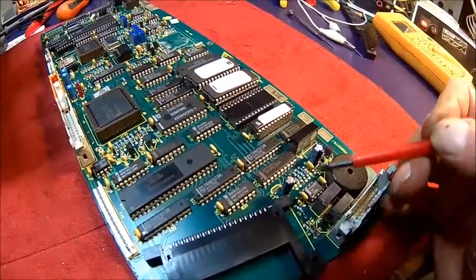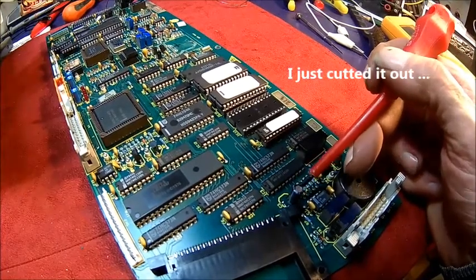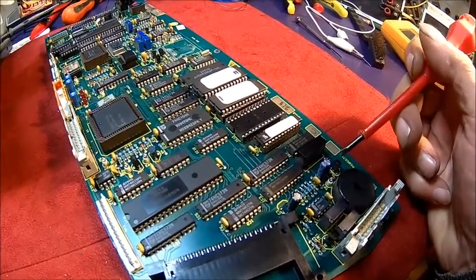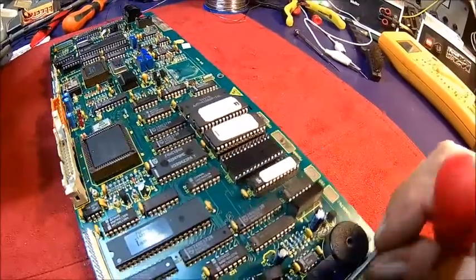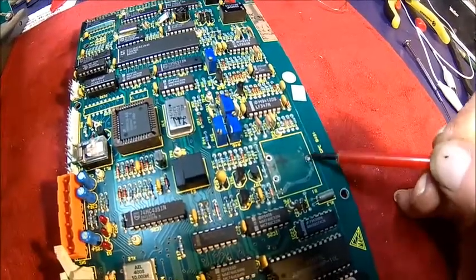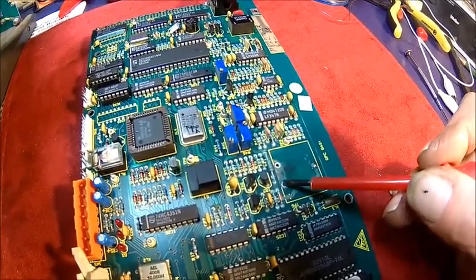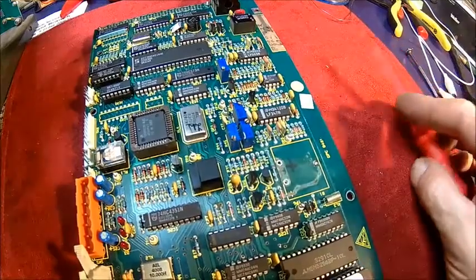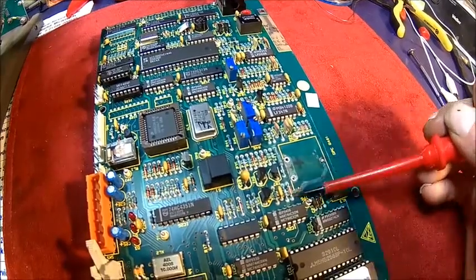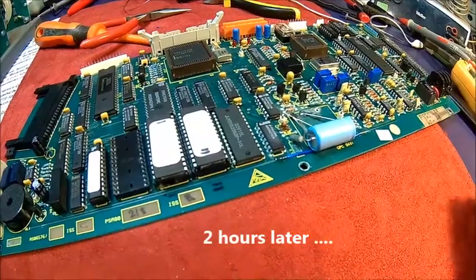We changed that capacitor. I didn't bother to unsolder the tantalum because with a multi-layer board it's a pain — I had real trouble getting it back in because I couldn't suck the solder out. We have another issue: there's no conductivity on that track. We just put a piece of wire in — it's around five volts — so we'll gold-cap it for now. It might actually be ground, who knows. We put a piece of wire over and a gold cap; that's the plan.